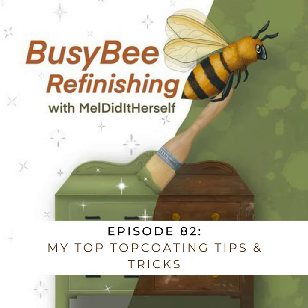My preferred top coat is a water-based polyurethane. I've used polycrylic in the past, but I find it doesn't dry quite the same — it doesn't self-level in the same way and there were always little bubbles left in the finish. Once I tried a polyurethane and it was more self-leveling and I didn't have to constantly work it while drying, I was sold.